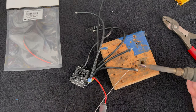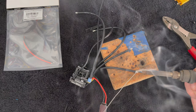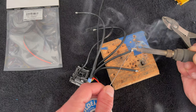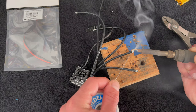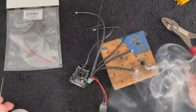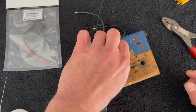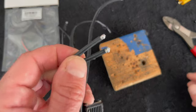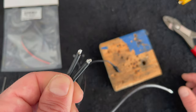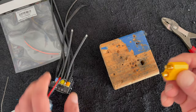When I tin the wires I try to have them lay sideways so the solder doesn't wick into the wire. I say solder - I know it's pronounced 'solder' in other parts of the world, but here I say it 'soder' - it's how I grew up. It's also pronounced aluminum not aluminium, just saying. When I tin the wires I have them lay flat so the wire doesn't soak up the solder, because solder is kind of a bad conductor - it's more to hold the wires in place than to make the contact. You want to get a decent amount of solder all the way around so that all the wires are covered. Now this is an XT90 plug made by a company called Amass.